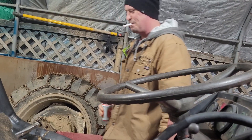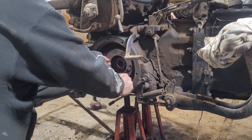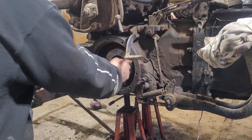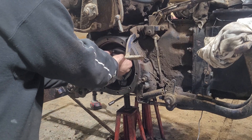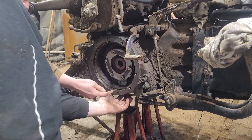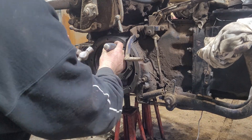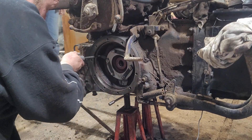So you found your leak — it had a bad seal? Bad seal, yeah. But it also has an o-ring on the inside of this hub, so it's got an o-ring on that and also a seal on the shaft. I think what was going on was the o-rings were bad and it was coming out from behind here — coming down to the open area and then coming up through the tubes. The tubes are right underneath the brake pad here — they don't stick up at all, they're right at the bottom. So they're a drain to keep your brakes dry. That was the only thing it could be. We were talking about the cotter pins that drop down through the drain holes in the bottom of that housing. We're just going to continue on with putting the lock clips on and carrying on with the rest of the work.